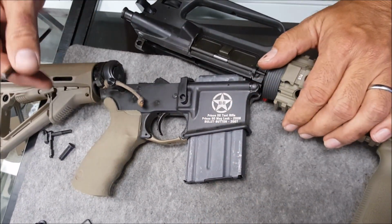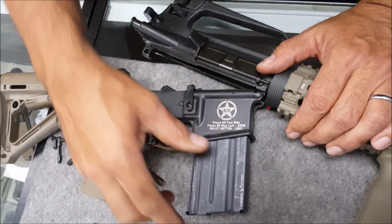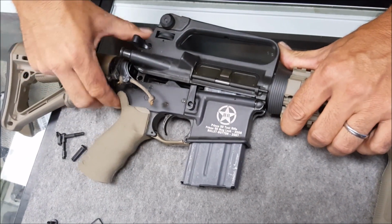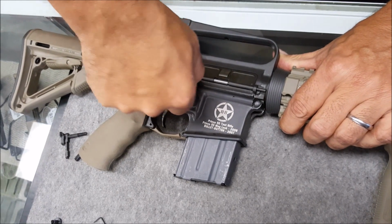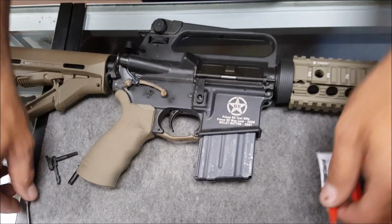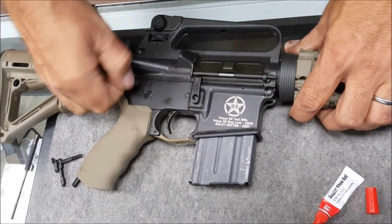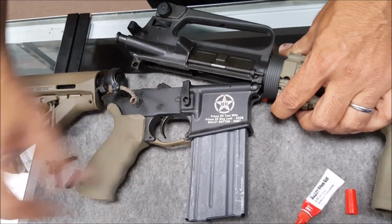When inserting a magazine and removing a magazine, both, that receiver has to be open. Okay, so we've now tried that. We're going to close this rifle. I'm going to push that closed, and I should not be able to push that by using the center bar, so we're good here. Okay, at this point in time, if you're happy with the operation, again, making sure that center button is not releasing a magazine when closed, but does release a magazine when open.